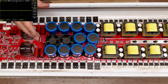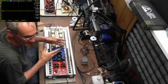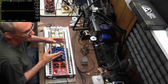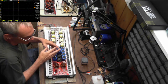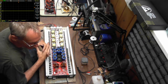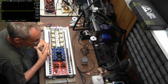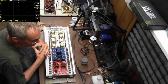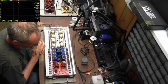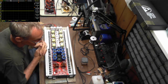And if you look up the data sheets on those, you're going to find that the 3005 I think has a lower current rating than the 3003. So I see more 3005s than I do 3003s. So I'm still kind of playing around to know if that is going to be the correct gate drive IC or not. I don't suspect it's going to be the 3003. These 4227s are pretty easy to drive.